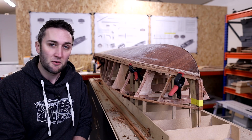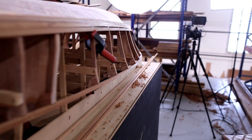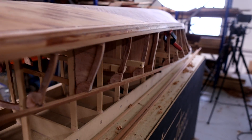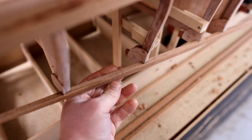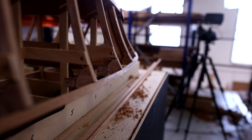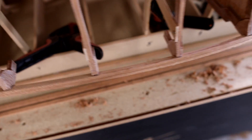Let's take a look at the shear clamp so far. You can see the shear clamp timber there with a nice fair curvature, and you can see that twist as it comes out back aft into the transom. We've got a really strong timber now with that four-piece lamination that's tying everything together, and you can see the sort of flare to that timber as we follow into those forward frames. We're just slightly proud of the frames on the control side, which is where we want to be.